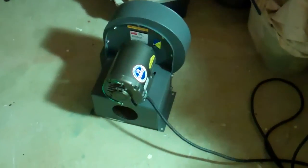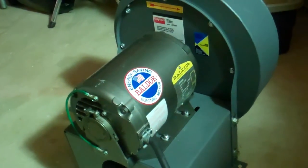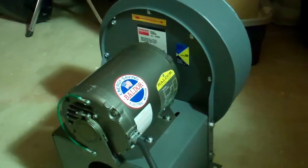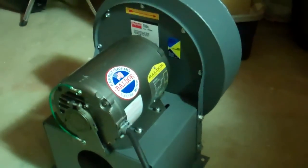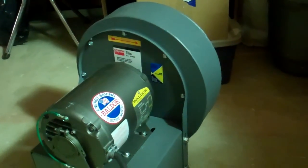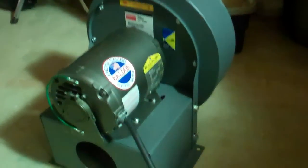It's going to do a number of things and I wanted to do a video before, because this is the last time you will see this with this motor on it. This is a quarter horse three-phase motor; this requires a half horse motor, single or three phase, that needs to be going 3,450 RPM. I want to do a single phase motor just because it's easier — I can just plug it in. It needs a half horse, I know I just said that, but yeah.